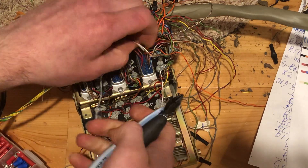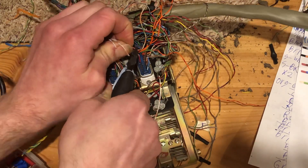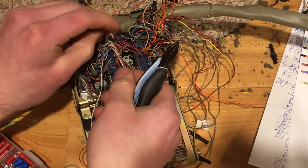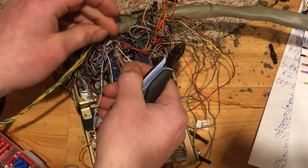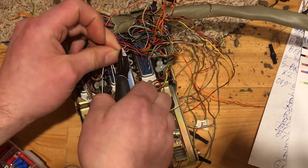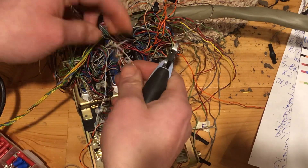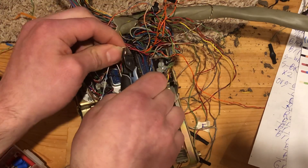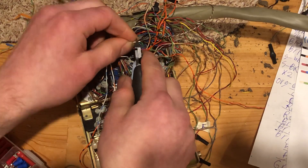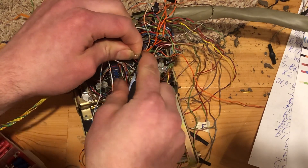I've also just been using the nippers to strip the wire. You usually just go ahead and make a tiny strip about as long as that is. I desoldered all of the wires that were originally on this because there was a whole cable soldered on here and it had been cut right at the base of the phone, so it wasn't really usable. That's a bit long so I'm going to trim it off a bit.